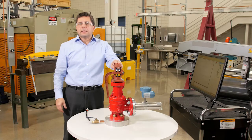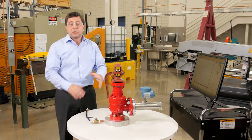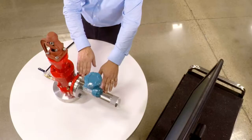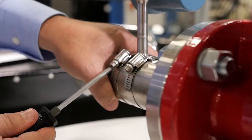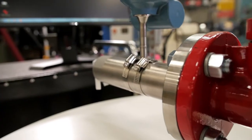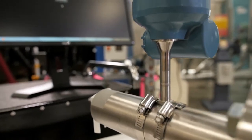This is a typical 30 psi spring-load pressure relief valve, but you can use any one you want. On the downstream of the valve we have the 708 clamped to the vent pipe, and all you need to install it is two clamps — that's it. The 708 is sending information via wireless HART protocol to a gateway which is connected to the control system.